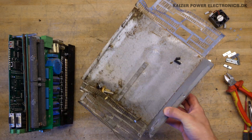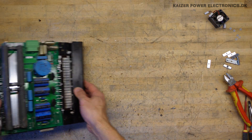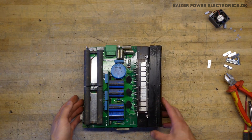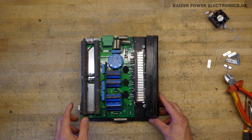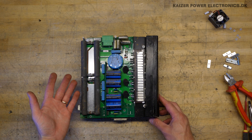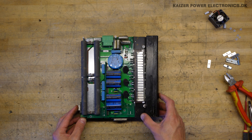Pretty smashed up shell — we have no need of that anymore. But quite an interesting power electronics part we have here — look at that. Huge braking resistors inside the drive. I don't remember the last time I saw internal braking resistors; those are almost always external.